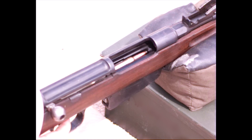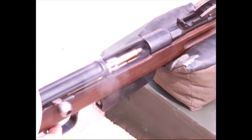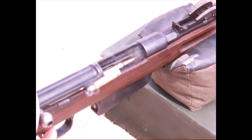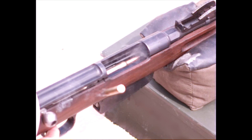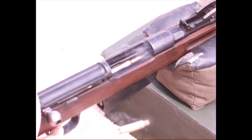Here's one more shot from the top. When you pull the trigger, the bolt drops — which has quite a lot of mass, making it a little tricky to shoot well. Then as soon as it is fully closed, the locking lugs rotate. There's then a fixed firing pin that automatically fires the round. The gas piston acts on the operating rod, which forces the lugs to rotate and unlock.